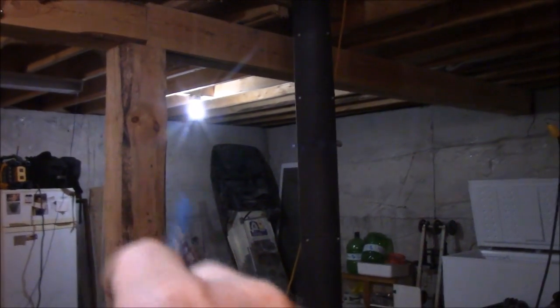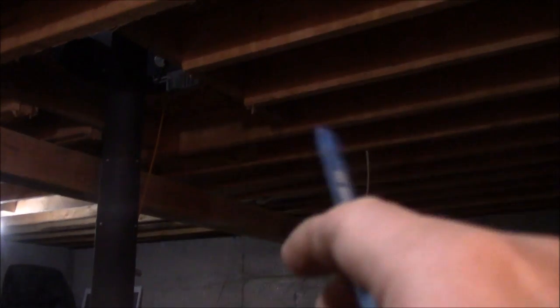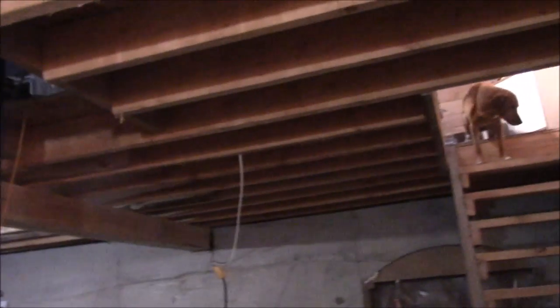So basically from the panel, which is at that snowmobile leaning up over there, that's where I'm hoping we can put it. Panel, the wire is gonna run up. It's gonna run across a few outlets, smoke detector, run across, up, power light switch, that'll run these lights down here, come down the light switch, across here, it'll run down through this wire, through this light switch, three-way light switch again, back up, across, over to here, then it'll feed that light down over there, feed that light, and feed this light here where the cord's hanging right now. So that's how I'm hoping.